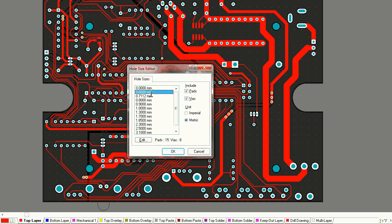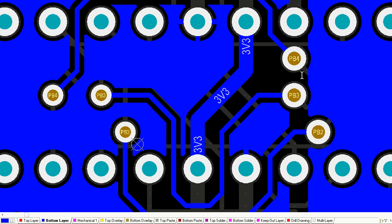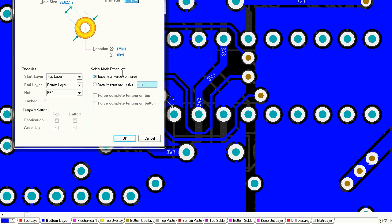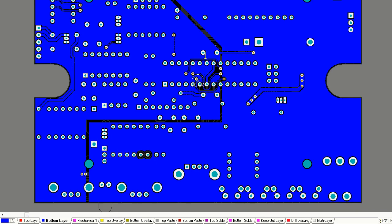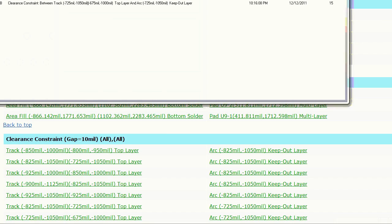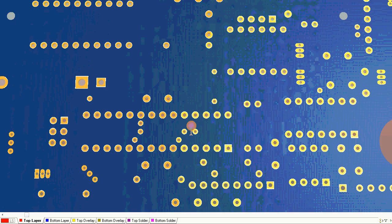When I'm design rule checking, I set 10 thou traces minimum, 10 thou clearance. So all of my rules and all those polygon pours, they will have a 10 thou spacing to them. So this is a very coarse board. I could make this at home easily. Any PCB manufacturer in the world could make this. Any backyard manufacturer can easily meet 10-10 rules.